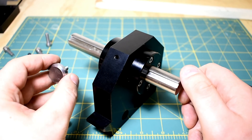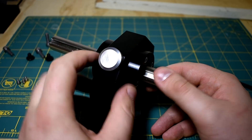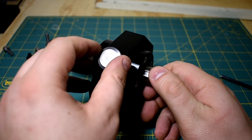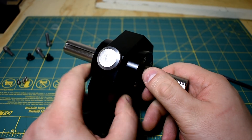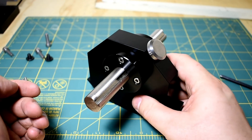The last part is just this thumbscrew for adjustment. It goes all the way through to the top of the key, so when I tighten it, it increases the tension on the key. It can either lock the tailstock in position or adjust the tension required to push it. So if I wanted to stiffen things up for a certain operation, I could use this. And that is the tailstock assembly.